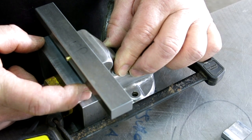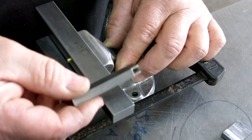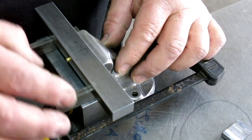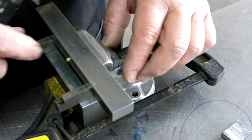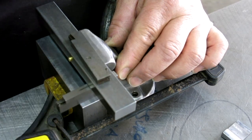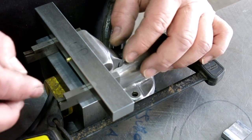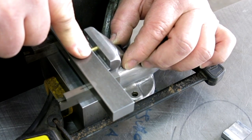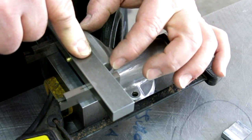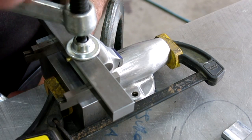What I need to do is put a spacer on either side that's the same height to make this parallel. I'm going to use my old faithfuls — these adjustable parallels. You just measure them with the calipers to make them the same height. They're nice handy adjustable spacers or packing blocks. So we're looking pretty good — I can pin this thing down, it just goes right in, and when I rock it side to side there's no wiggle. That's exactly what I want.